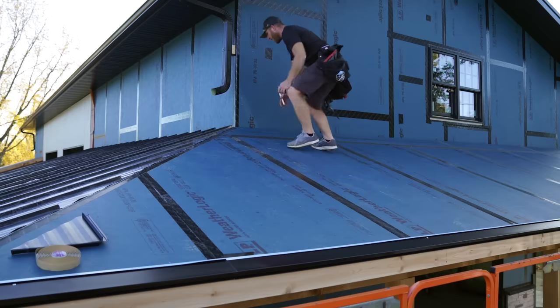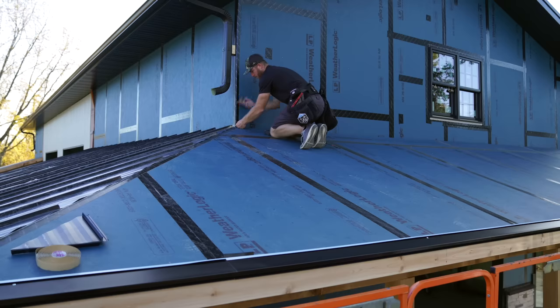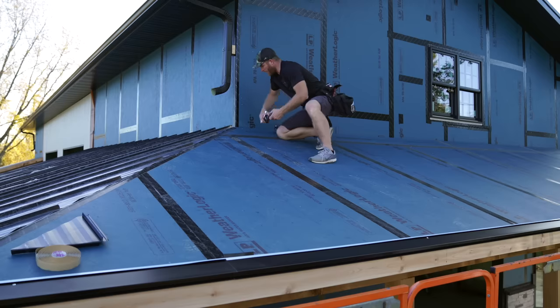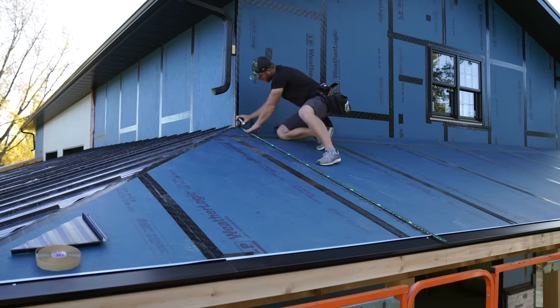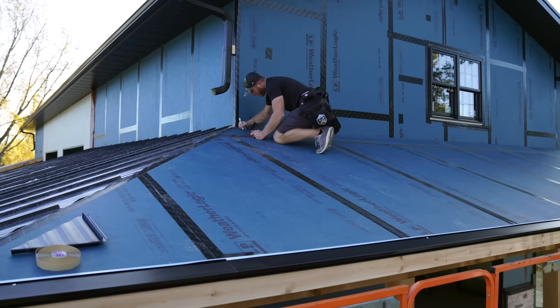Now I know that the goal, and it looks like this side worked out, is my center of my rib dead on, right on the corner of the building. So if I wanna assume the same thing is gonna happen here, what I've gotta do is square this up. The easiest thing I know is just to use the Pythagorean theorem. Right here, I'm gonna mark 9 foot, and I'm gonna come off my building, because this is what I want. I want this to be right here.